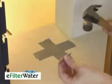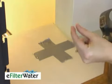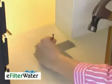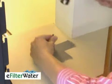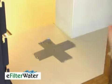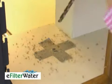You can take either a nail with a hammer or you can take a small drill bit. What you want to do — I'm using a nail — is take the nail and put it in the middle of the hole. All you want to do is just put a small starter spot so that as you begin with the drill, your drill bit won't be wandering all over the counter making a mess. That was easy.